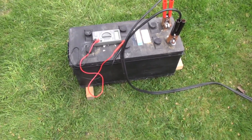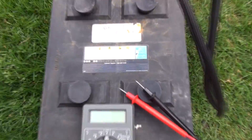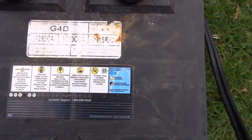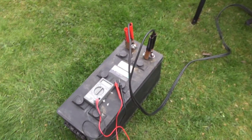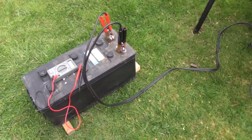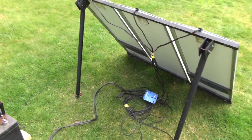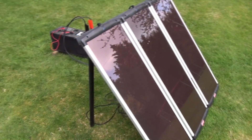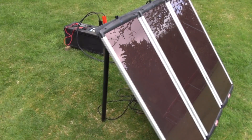This is a big Group 4D battery — a really big one used to start up generators in the hospital. It has 1250 cranking amps and is very heavy too. Unfortunately I had let this one slip down to about 9.5 volts, as you probably saw in a photo I put in this video. But I'm going to use the solar panel here to do a very slow charge. I think it will work and should bring it back up.